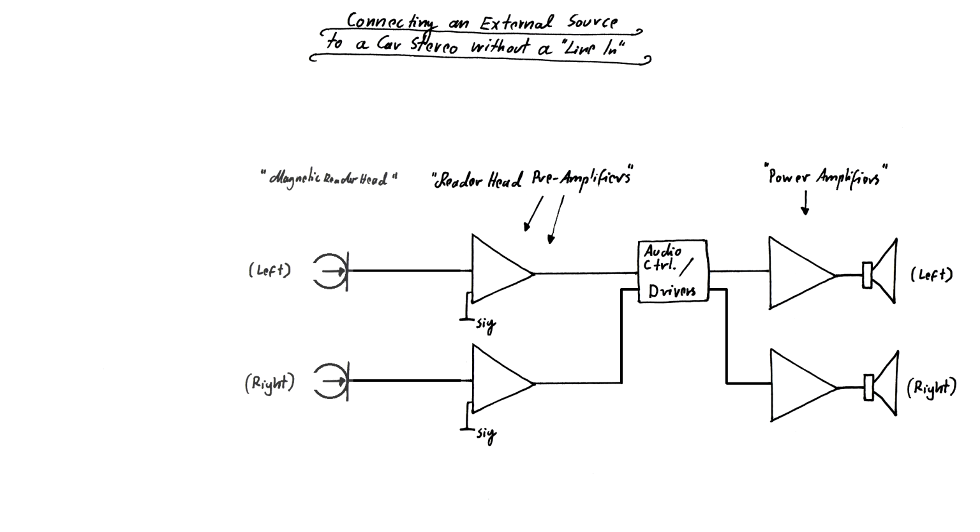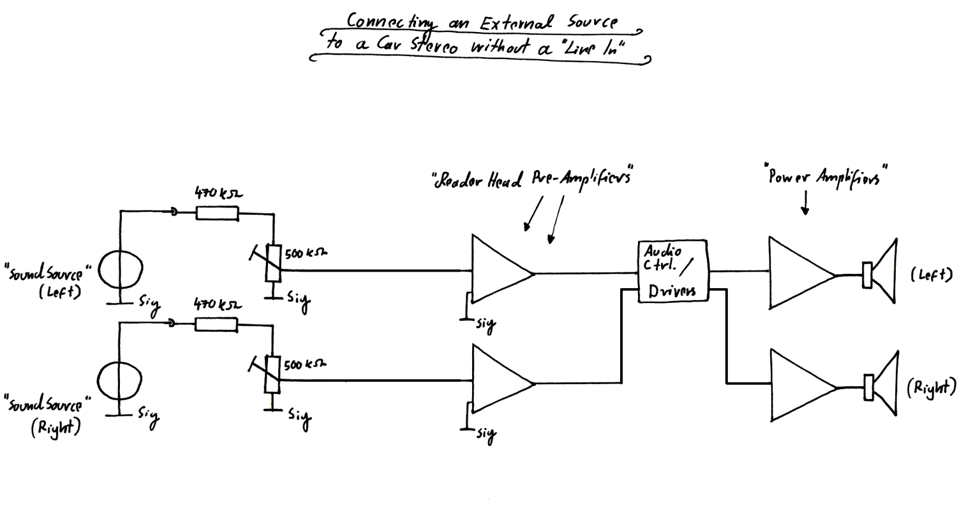By removing the cassette drive, the inputs of the preamplifiers are theoretically free to receive a signal from just any other voltage source. It might seem a very abstract concept, but on this level, a computer, MP3 player, smartphone or a Bluetooth receiver simply acts as a voltage source. These sources, however, are too powerful to be connected to the preamplifier's inputs directly. Therefore, I will add a small board with adjustable voltage dividers to step down the signal to an acceptable level.